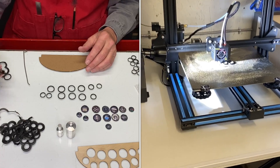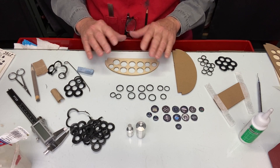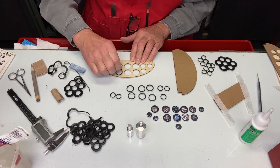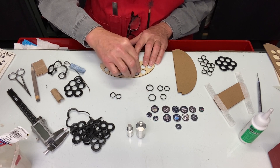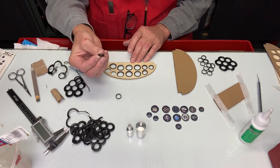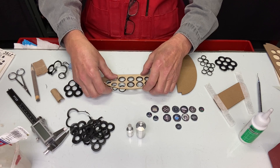The 3D printer was producing these instrument bezels. Once that's done, we do a trial fit. As I mentioned in my shop setup video, a glass surface is perfect here — when you're pre-fitting instrument panels you need it absolutely flat to make sure the bezels are sitting at precisely the right height. If the surface is uneven, the bezels won't all be at the same elevation in the panel. Using a 3D printer and laser, the fit is unbelievable — like 99% right away.